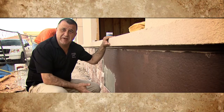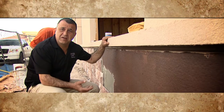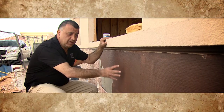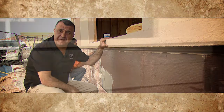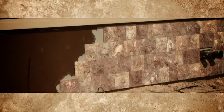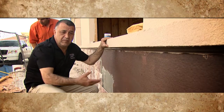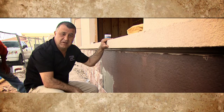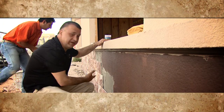After installation of the cement boards, you come back and waterproof it. Before you waterproof it with waterproofing membrane, you can go ahead and tape the joints, then waterproof it with the many different products that are available for this purpose. Right after that, you can go ahead and start installation.